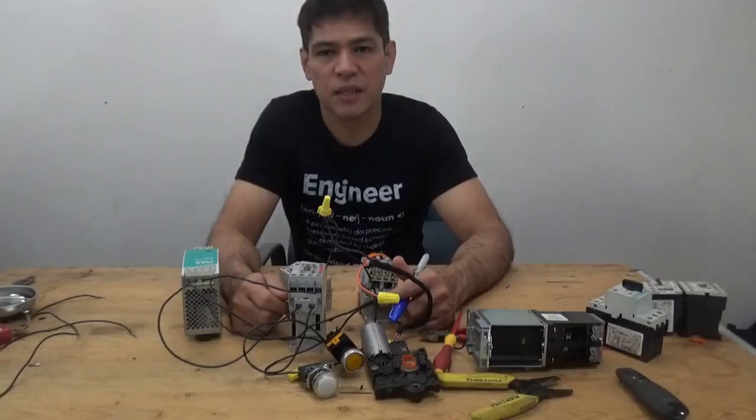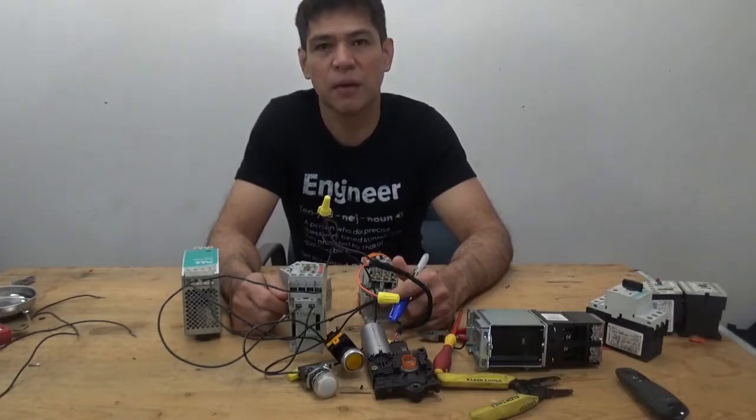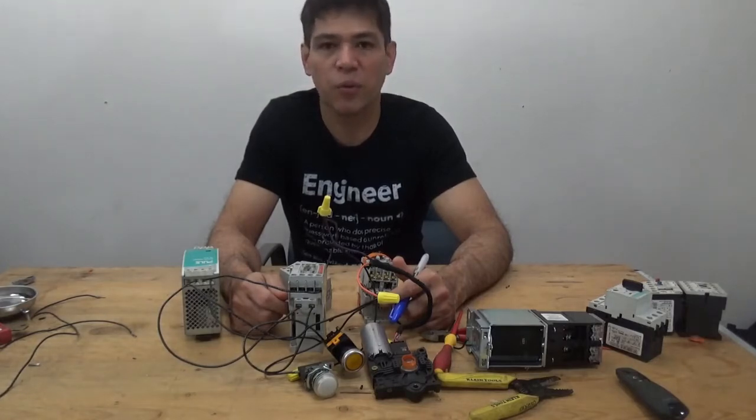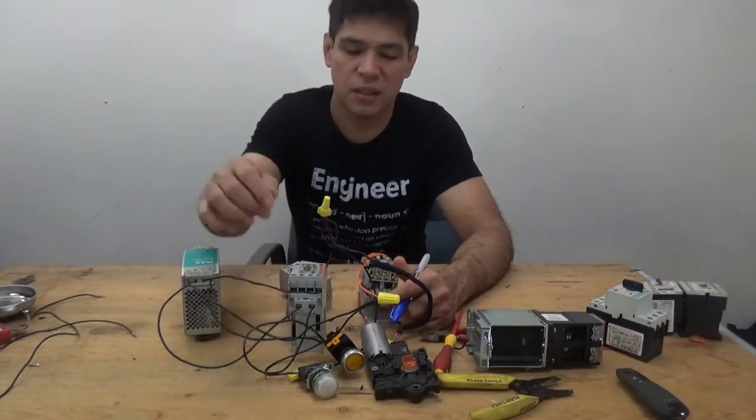Today, we're going to discuss the motor starter. The purpose of a motor starter is to allow us to start and stop a motor safely. And it also allows us to start and stop from a remote operation. Basically, a motor starter is an electromagnetically operated device that starts and stops a motor load. It consists of an electrical contactor and overload relay, which provide short circuit and overload protection. Now, we're going to our computer to discuss in more detail, then we do our practical exercises.